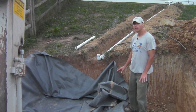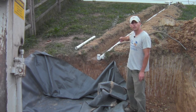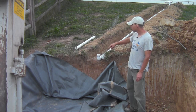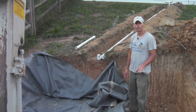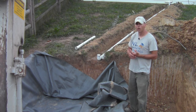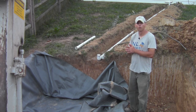We were able to get most of the wetland area dug out today. This PVC pipe that connects to the house is where all the gray water comes from. The gray water comes here and we 90-it at the end so it will go over the wall and spill in. The depth on the wetland area should be 12 to 24 inches deep — I was thinking 24 inches, wanting it on the deeper side so the reeds can really use the full depth of their root system.